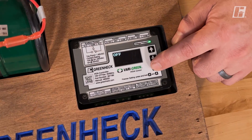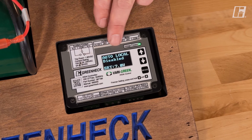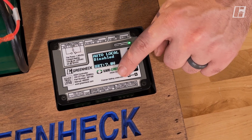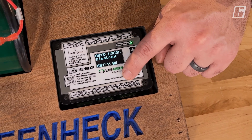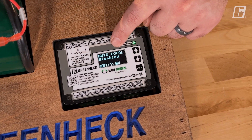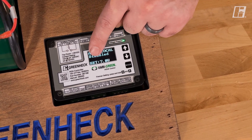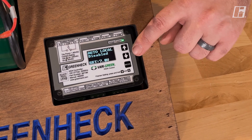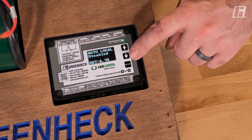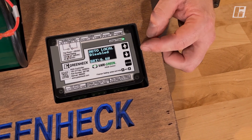The next mode is auto local mode. As you can see on the screen, 'auto local' is a two-part command. The auto part says to watch the dry input and voltage input auto terminals for a remote signal to turn on or off. The local part is where you get your speed reference from — since it says local, it's getting the speed reference right from the HOA. You can change the fan balance or flow rate simply by pressing the up and down arrows and leaving it where you're happy.